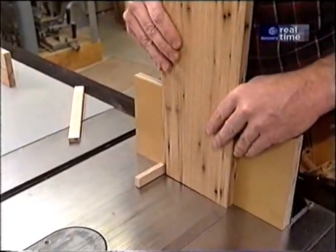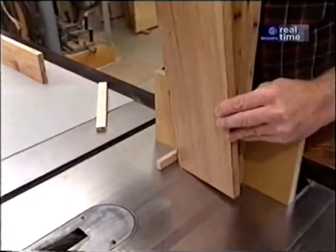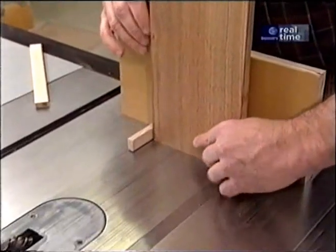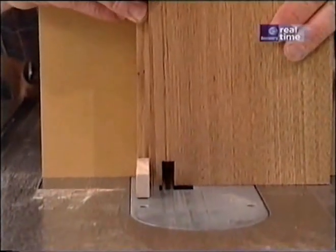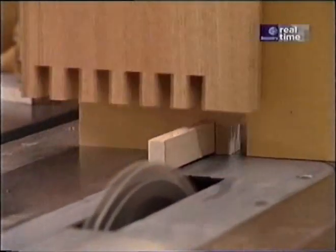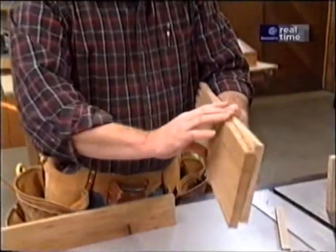Here I very carefully label the corners of the box so that I keep them in the right orientation. The first thing I do is take one piece, place it in the jig, take a piece of hardwood exactly the same width as the pin, place it against the pin, slide the stock against it, and run it through. With the first pass complete, I slide it over once again, take the matching corner, clamp the two pieces together — it'll be easier to keep them straight. Each time I make a pass, I move it over and drop it over the pin until I get all the way across the piece.